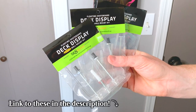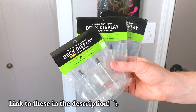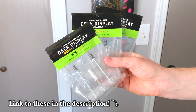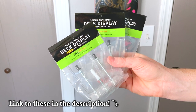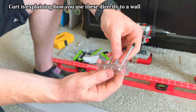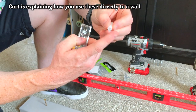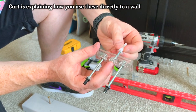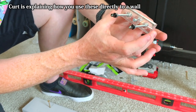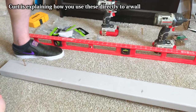For your more permanent solution you're going to need some floating skateboard deck display wall mount kits. We ordered these off Amazon — we'll have the link in the description below. This makes it look really cool and it is a permanent solution — these definitely go straight through your wall. It does come with a wall anchor so you can hang these up wherever you want; it doesn't have to be through a stud. You tap the plastic anchor into the wall flush with your drywall, then tighten the screw to anchor it so it won't keep spinning and will pull tight to the wall.